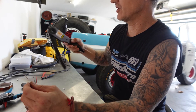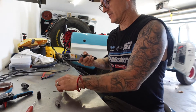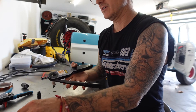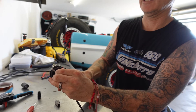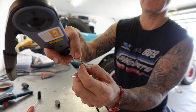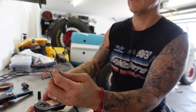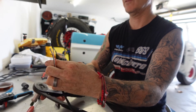Just a little bit longer than a finger now. Then put this thing on to 18 — it's already on that. Make sure it's pretty much flush there. Put the wire in, make sure it's all the way, and just crimp it down and give it a little pull and it should be good. There you go, another one down.